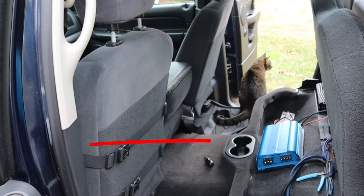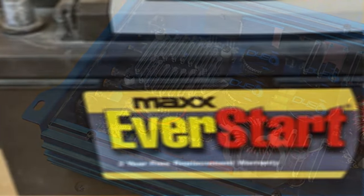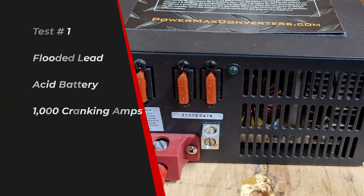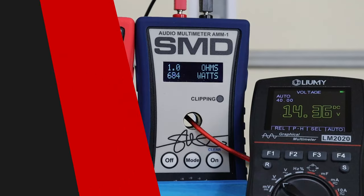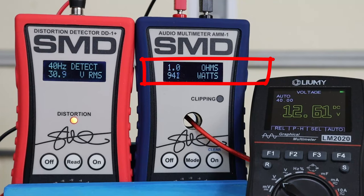For this test we're going to be using the JP8 amplifier from Down for Sound. We'll start by measuring the one-ohm power using the big Walmart battery. I started by hooking up a 100-amp power supply in smart mode to charge up the battery, then switched it to what I call Leroy Jenkins mode, which is designed for directly powering a DC device. This setup approximates a stock electrical system in a large vehicle — 100 amps from the alternator plus a big battery. The red light on the red device lights up when we hit 1% total harmonic distortion.